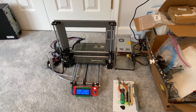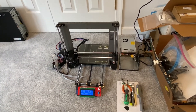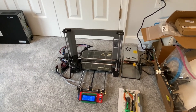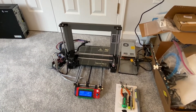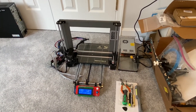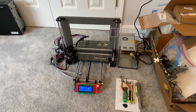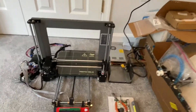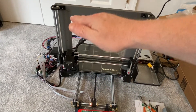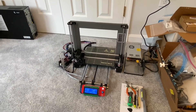That's why I think it needs the actual Prusa sensor — they call it a PINDA sensor. It's an inductive sensor that detects metal. Their sensor is sensitive to four millimeters, whereas these clones can only be sensitive up to two millimeters max. I think it needs the four millimeters to detect the bed as it's coming down — you start the test with the Z axis all the way maxed out, and it's motoring down. I don't think it's able to detect the bed in enough time to stop the motor.